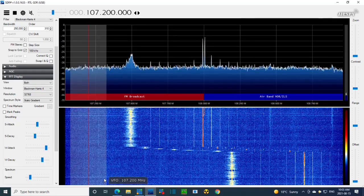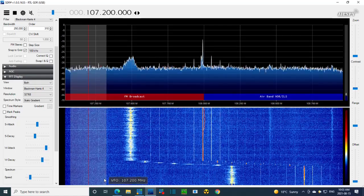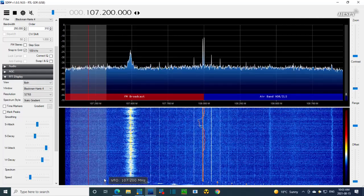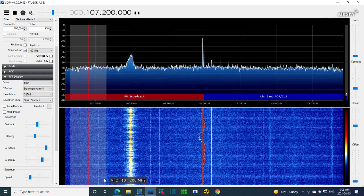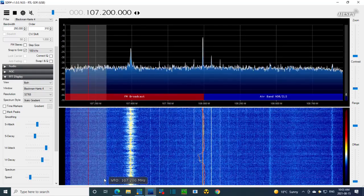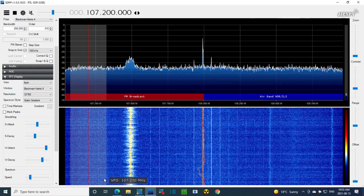Well, so I've changed the level control for the marker generator, and it's moving the frequency back and forth a little bit. It doesn't really change the level very much. In fact, the level's higher when it's set lower. So exactly what that is, I don't know. It just says marker. It says marker amp as an amplifier. Okay, we're going to leave that. So it's running right around 108. It's like a fine frequency adjustment in the end.